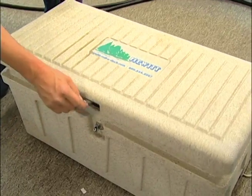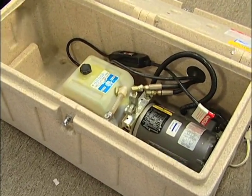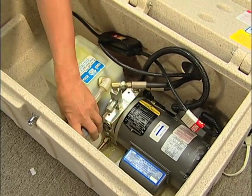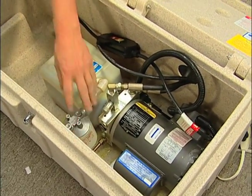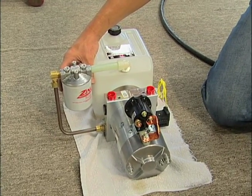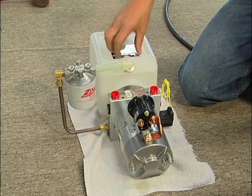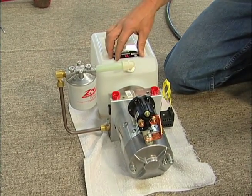My lift is slowed down or the pump has developed a squeal. There is an external filter on the outside of the pump. This filter would be the first recommendation to change. If that doesn't take care of the problem, there is also an additional filter inside the reservoir.